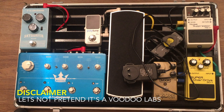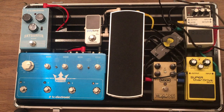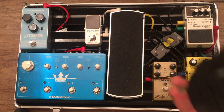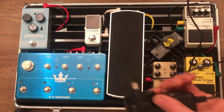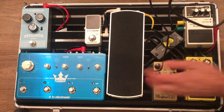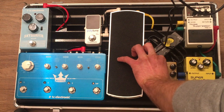I did mention in the other video that I suspect power supplies such as the Voodoo Labs are going to have a much more effective form of isolation than a cheaper thing like this does. One thing we can look at there is that the Voodoo Labs probably takes wall voltage straight into the unit with a jug cord, whereas with this you get a transformer that goes into the unit. So this is my pedal board — this is what I constantly run with this pedal power supply.